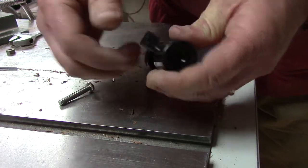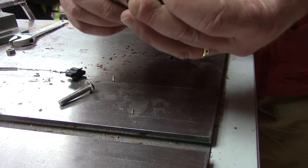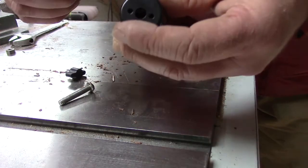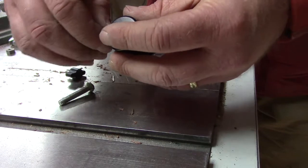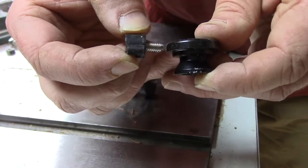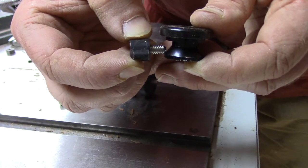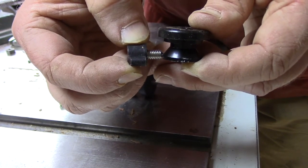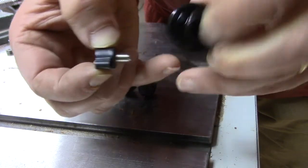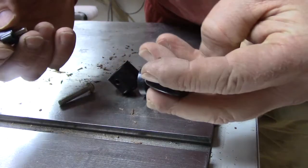The things don't lock into place. And when you pull out the set screws, you can kind of see why, and you pull it the rest of the way apart. In a nutshell, the thumb screw is drilled too high. So whereas the thumb screw should come in and bite here on the wedge, it doesn't — it bites right there. That forces it to cross that flat bit before it can even start wedging. It basically means most of the time it doesn't do anything, and the mount never tightens up.